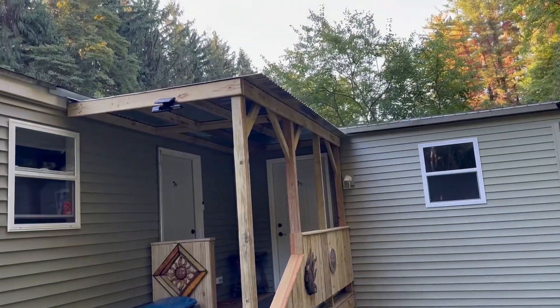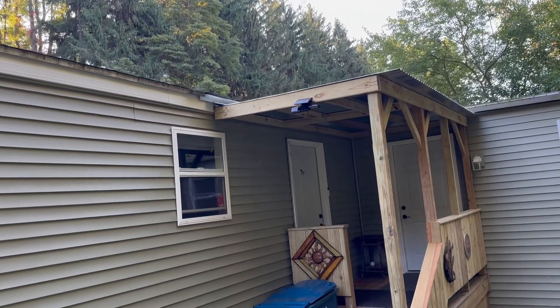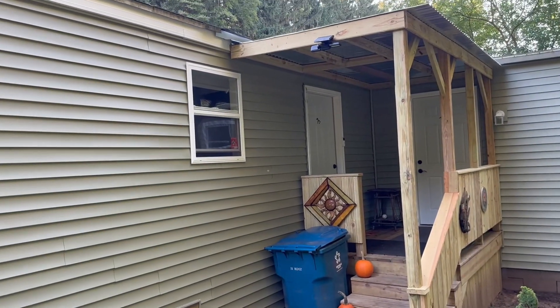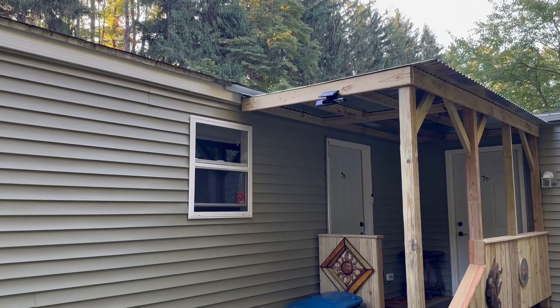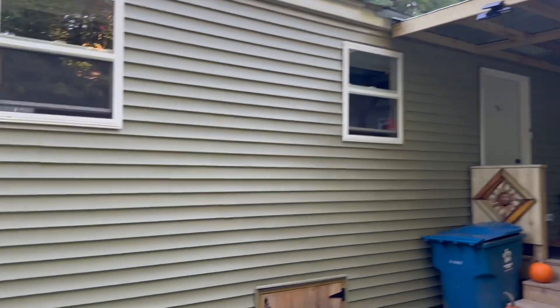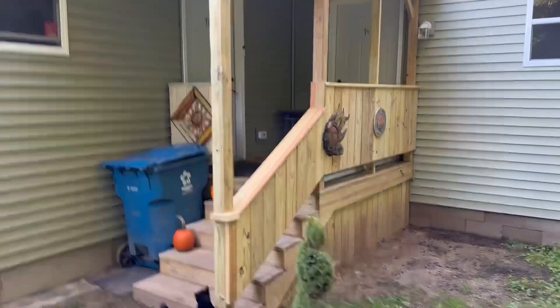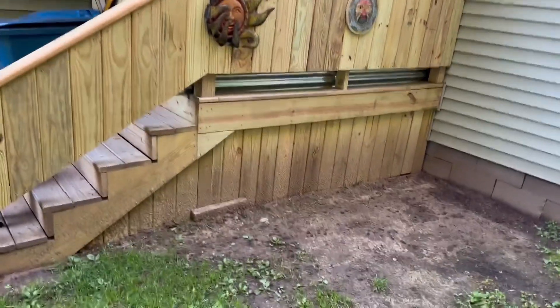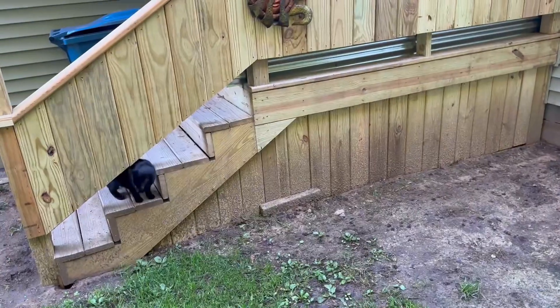I kept it kind of flat only to follow the flatness of the roof on the addition — it's not truly flat, it actually pitches a good one inch. We had to flash it really well up there. I had to repair a lot of the roofing on the trailer itself where the porch roof joined, because the sheathing was literally rotting — I put my knee right through it. So I removed all the roofing and replaced a two-foot by eight-foot section of sheathing, then re-roofed it and flashed it in with the tin roof.